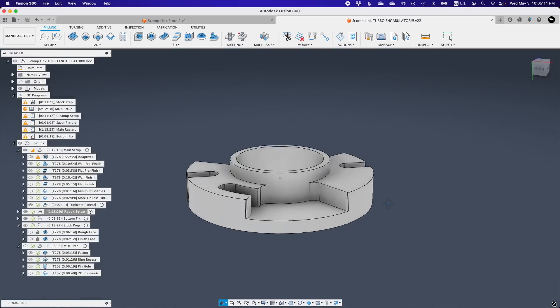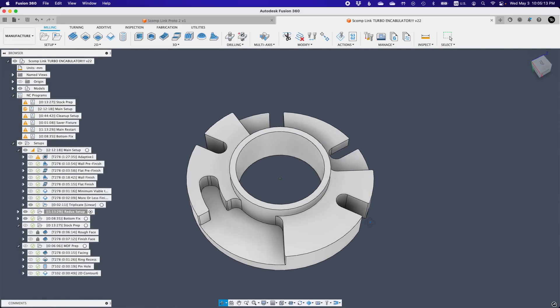It's a mental exercise I think anyone who's considering taking on projects in a job shop type capacity needs to go through. If I'm designing a part, I will both consciously and subconsciously limit myself to creating features I know are within my capabilities to produce. But a part that you get from someone else may not conform to the same design for manufacturability guidelines that you would adhere to. Communicating with a client about what is and isn't practical for you to manufacture is important in order to set the appropriate expectations on both sides of the deal.